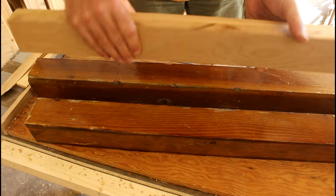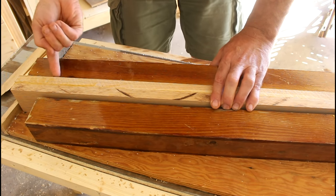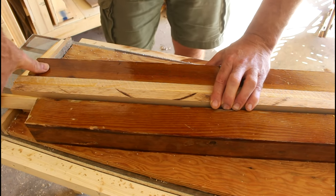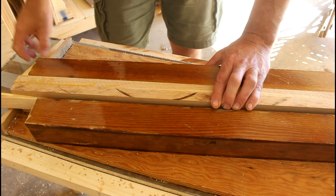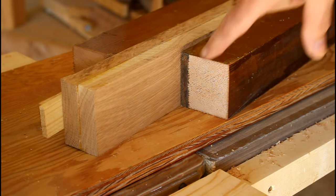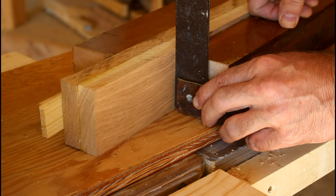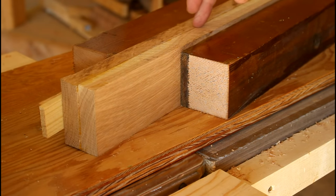What this allows me to do is take my stock, put it in, and make sure that this side is up against this board. I have this other one here so I can take some wedges and push them in to make sure that I'm pushing this board up against this side, and I also do that on this end. So you can see that this side of the board is up against this board and I know that that's perfectly set at 90 degrees. The wedges hold it in so this can't go anywhere, and then I can run it through the planer.